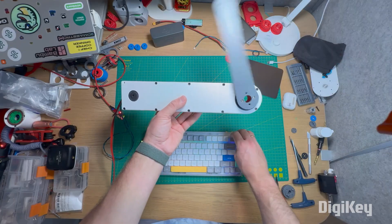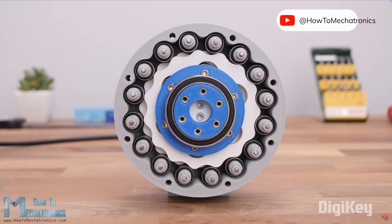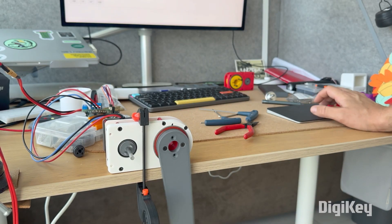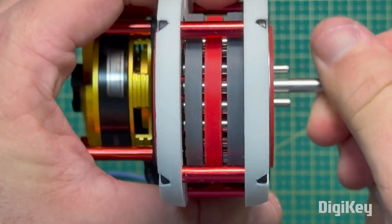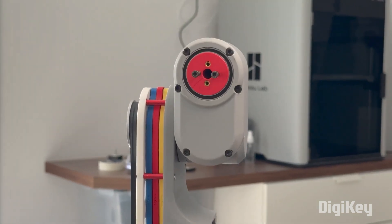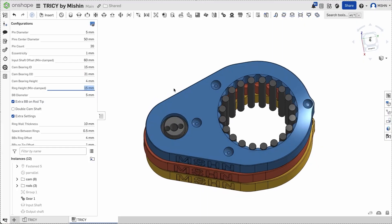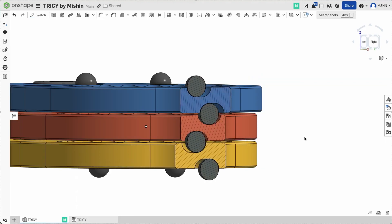Now for some tips and tools. On his YouTube channel, Sergey from Mission Machine demonstrates how he created a unique, clever three-ring cycloidal drive. The design uses 3D printed parts along with a handful of ball bearings, steel pins, press fit bearings, and a brushless motor. Aside from looking super cool, the gearbox offers a 20-to-1 gear ratio in a compact package ideal for robotics — maybe make a few for your DIY Olaf project. Best of all, Sergey shares the Onshape CAD file for the design so you can play with it too.